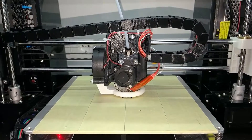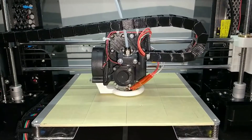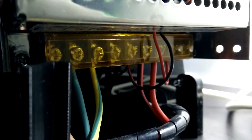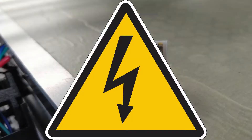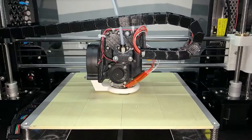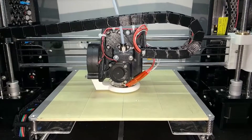It's a great printer after a few upgrades and invested time. However, danger is lurking all the time, either because of open mains contacts at the stock PSU, or too thin wires or connectors at the heated bed. I have already dedicated a video about how to increase safety at the stock PSU, which you can find in the top right corner — make sure to check it out.